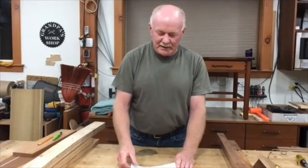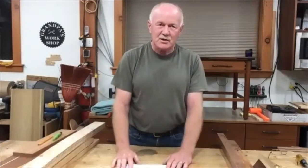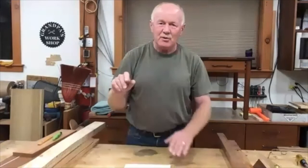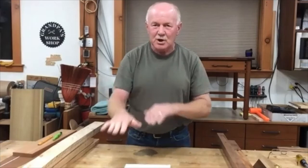Another issue you need to deal with when you're going to the lumber yard to get your materials is thickness of boards. And that's another thing for that cut list to come in handy. If you need to end up with piece parts that are 7/8 of an inch thick, let's say, you could say, okay, I'll buy 4/4 boards. Those are 1 inch thick, well, they're 1 inch thick when they're rough sawn. You need to have 7/8 of an inch thick after it's been flattened on the jointer, planed to get parallel and smooth surfaces, and then final thickness after you've allowed for some potential expansion, contraction, twisting, bowing, you know, things happen.